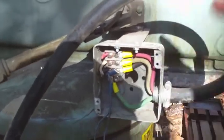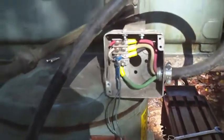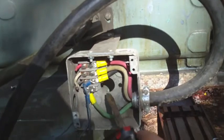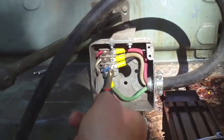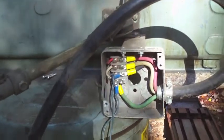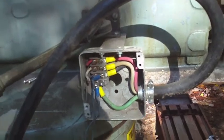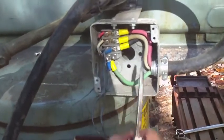And what I mean by floating is that there could be a potential for voltage on the machine. Touch the table, and then touch a better ground, and you've got current flow through your body. Not good. Anyways, you don't want to use your ground as your return path. Pretty sure that's a code violation. Not an electrician, but sometimes they try and do that in old houses. And that's a no-no, because if you end up with a bad ground connection down at the box, it can be a fire hazard, I think. I think that's why they originally banned that kind of silly activity.